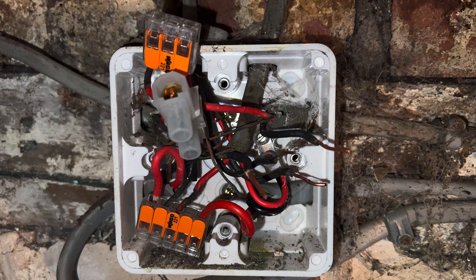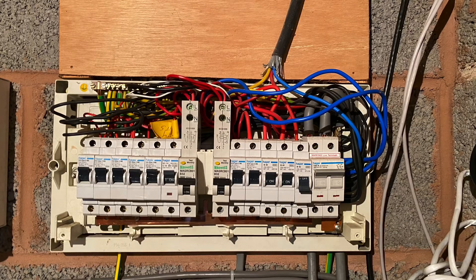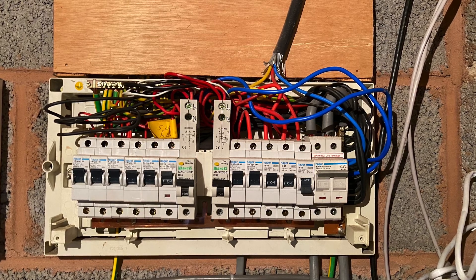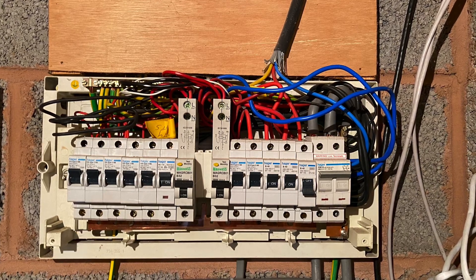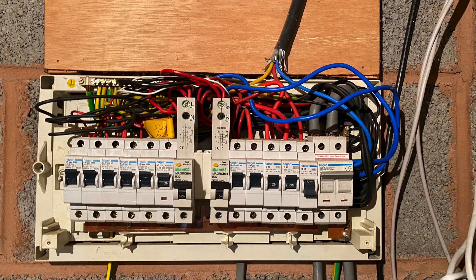However, your knowledge might be just turning up at college with no experience of electrical systems. So if you look at picture number two, the obvious thing to us is there is a risk of electric shock due to the fact there is no cover on it. You can see at the very bottom where the MCBs are connected to what is a brass bus bar — often called buzz bar, but it is a bus bar. There's no guard in front of that, so in this case we could easily receive electric shock.